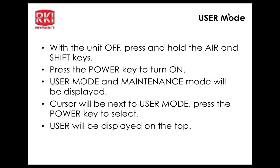Okay, and now the reverse. So channel number 1 is now H2S and channel number 3 is CH4. Whatever channel you select initially will start flashing. The second channel you select is going to swap out, basically positions, with that particular sensor. So we'll change it back the way it was.